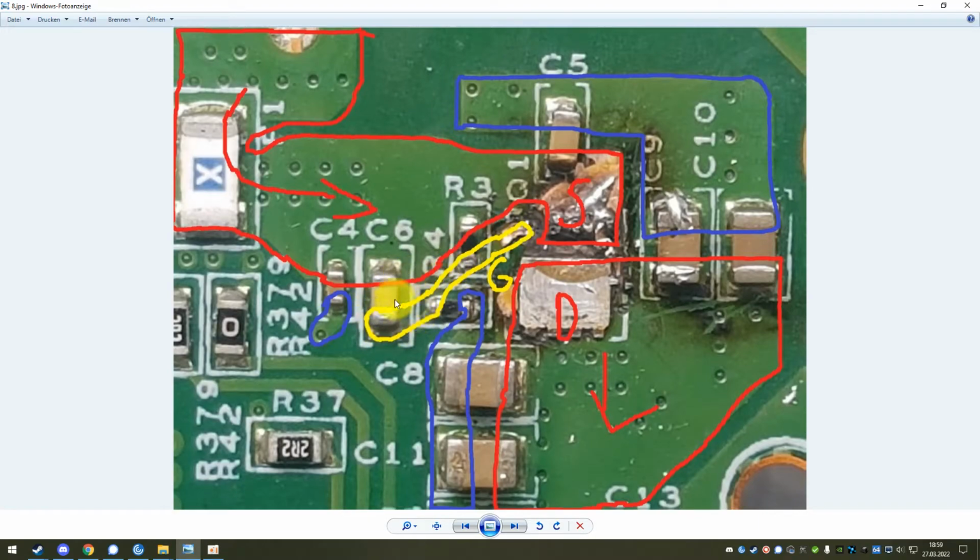So you have the one capacitor on top, you have the resistor on top, and then you have the other resistor going to the bottom. These resistors are the voltage divider, and together with this capacitor they form the time delay circuit that slowly brings the gate voltage down, and at some point the MOSFET switches on, current can flow from source to drain, and basically then your circuit is on. And these four capacitors are the ones that are shown in the circuit diagram.